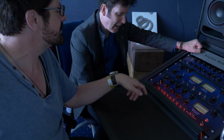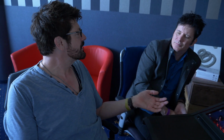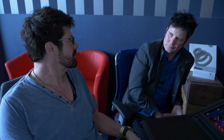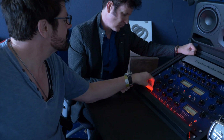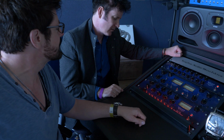And you have a line input. That was something we hadn't in the first version, but then there came requests because many people get pre-recorded tracks from clients. They record on their own, and they get it for mixing, and they said, I want to run it through, especially the vocals, through the channel strip. And when I'm coming from the converter, it's too hot to use the microphone input. So we decided to make a second input, also with a transformer, and have a different gain structure. So you can connect your converters and also use it with the switch for your microphone. So if you want to reamp something, then it's really easy.